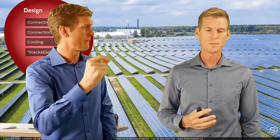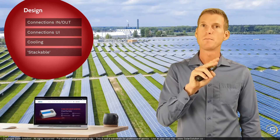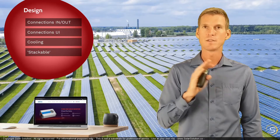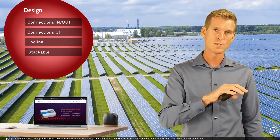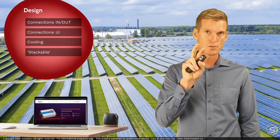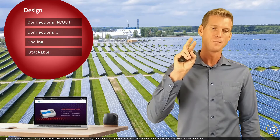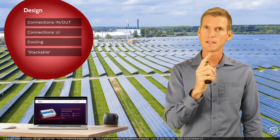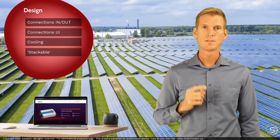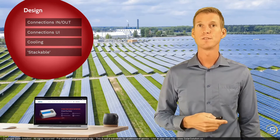Would it be possible to connect a similar device and have them work together as a pair? This is really important. You can use different sets of panels, each with their own charge controller, but the two charge controllers need to be compatible. Normally you'd choose the same model and connect them so they can communicate and operate in sync. This is quite important to consider if you might want to expand your system in the future.